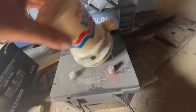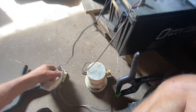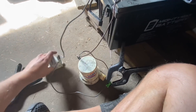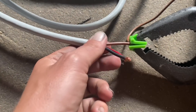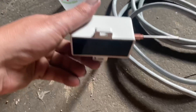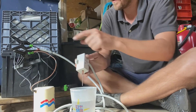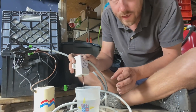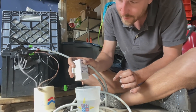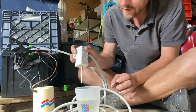I tested the old switch and it works fine, so I guess it was just bad wiring before. Let's test out the new switch. This switch has three wires instead of two like the float switch — maybe it uses electricity. You have to have the black and red wires hooked up to the switch and the brown hooked up to the pump. I put the very tip in a cup of water — that turns it on. You take it out and it's still running.